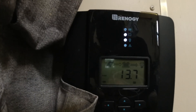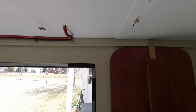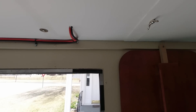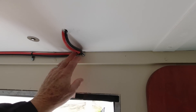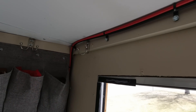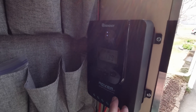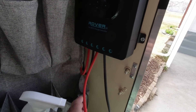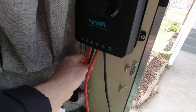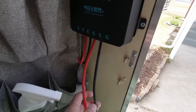It's putting out voltage — I've got 13.7 volts coming in, and that is such a good feeling. As you saw in my last video where I put the solar panel on the roof and ran the wires down through the ceiling of the trailer, this is them coming through — a very simple installation, nothing's hidden, the wires come right down to the Renogy MPPT controller right here. Today I want to finish up these wires: where the power comes in from the panel, where the power goes out to the battery, and I need to put a fuse in here.